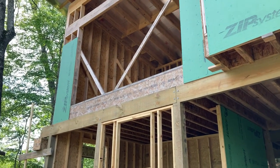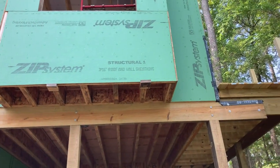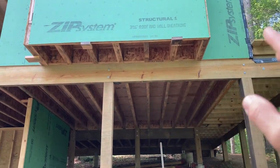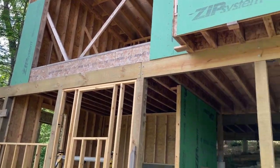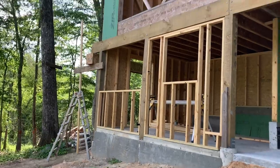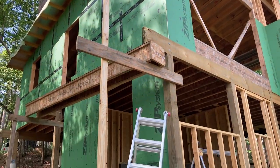There is going to be a ledger board up there for the deck, so I might just go ahead and sheathe all the way up over this beam — that'll make this whole front section a lot stronger. The deck should hide the little bit of unsquareness we have there. The house is perfectly square; I made sure to square it up along all the beams before we put all the joists on. But just the way these footings were laid out, this side ended up being just a little bit out of square.